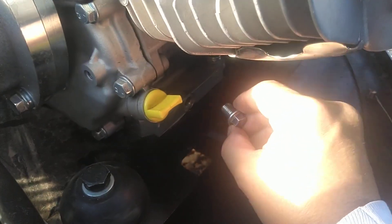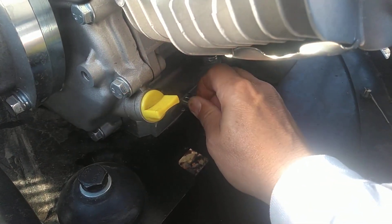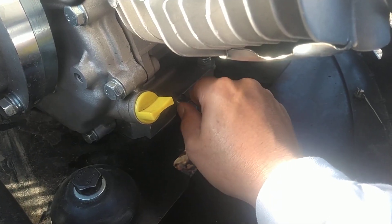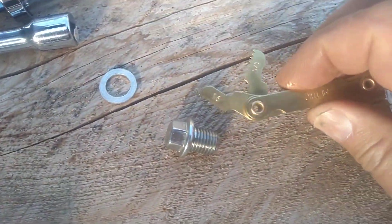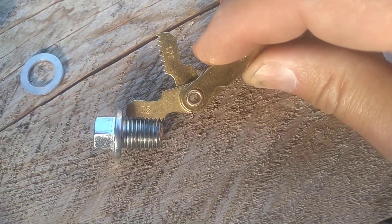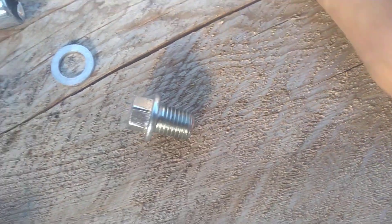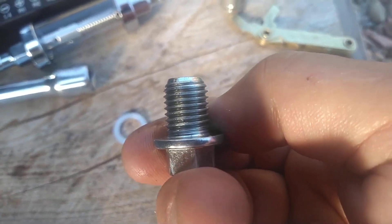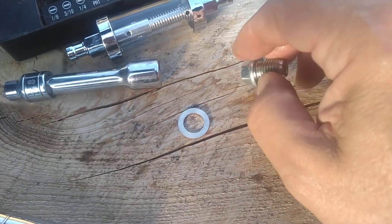But for those of you who want to add an extension hose to the drain, this is not an SAE thread — it's a metric bolt. I measured it out this morning and I have a metric thread gauge here. You can see this is a 1.5mm pitch thread. I took a caliper and measured this bolt thread; it's 11.8 something millimeters, which makes it an M12 bolt — M12 by 1.5mm.